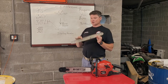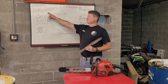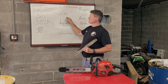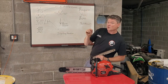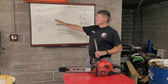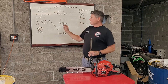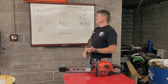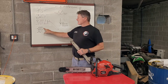Now, this one throws everybody for a loop — the actual chain sizing and bar sizing. You have three basic sizes of chains — these are your pitch. There's three-eighths, which is usually for your larger or professional saws. Then 0.325, which is for 50cc saws right in that range. And then three-eighths low profile — it's the same pitch as three-eighths but real short so a smaller saw can pull it. These are for your homeowner saws or possibly tree-trimming saws.